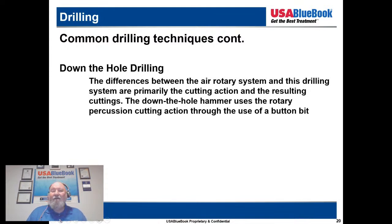Well, I was always amazed when I was first introduced to well drilling that they say you're cutting that in and you slide in the casing behind it, and I'm like, how does this work? Do we just leave the cutting head down there when it's done drilling to the depth? Because how do you get it back out? I didn't realize that the cutting head expands on those two or three different size cutting wheels, and then when it stops and they reverse it, they retract. So that's what allows it to come back up through the casing pipe. It's one of those weird, wonderful things you don't stop and think about until, like, how are they going to get that out of there?